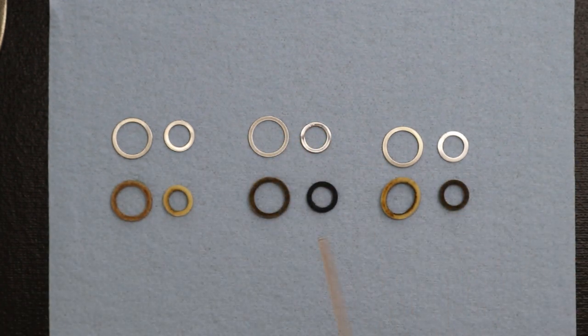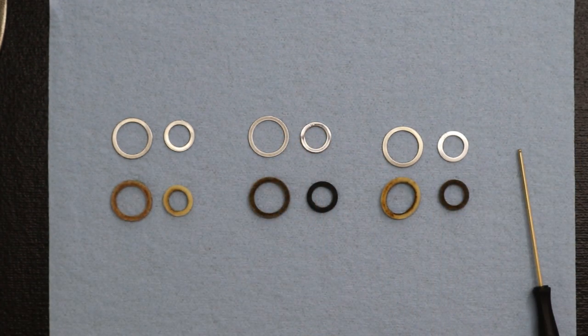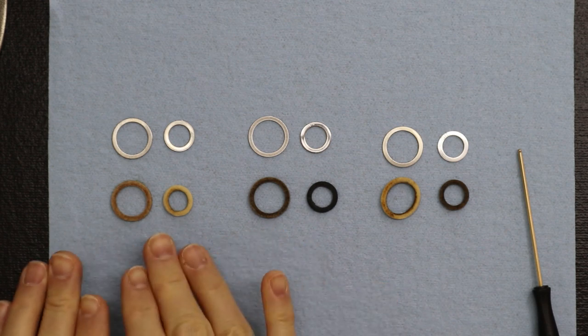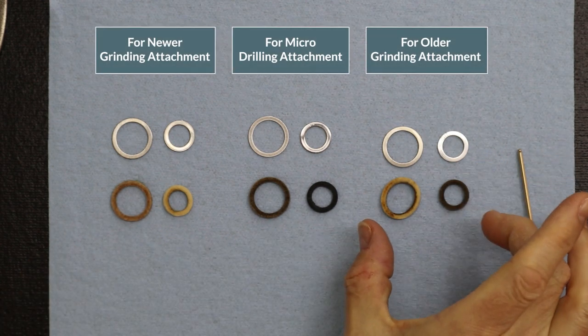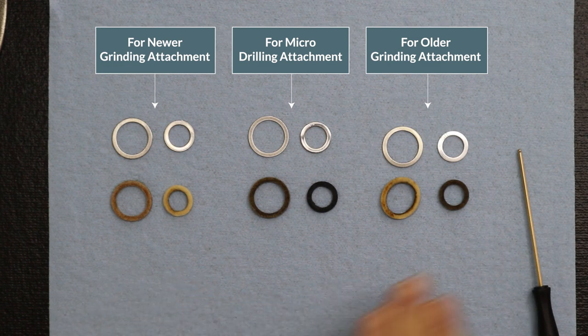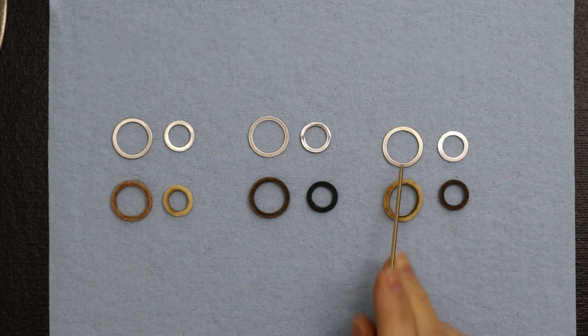But this is what's really interesting. We don't mix and match the grades with the sets for the different spindles. The reason why we have them laid out like this is because this is for one specific spindle, and that is for another. So we keep track of where they go on what particular spindle. And if you notice, this is actually the front of the spindle.